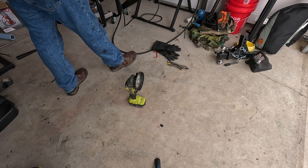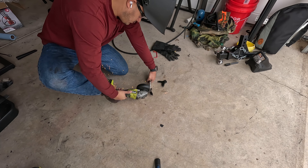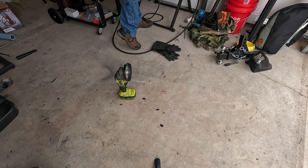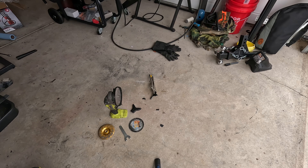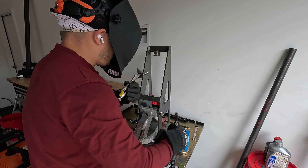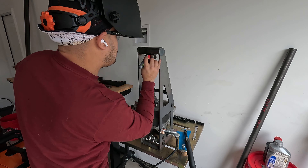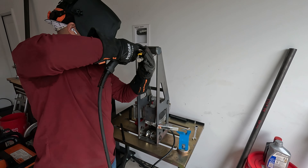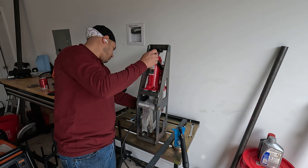Bleeping Colt cut the spring bracket in half and welded the sides onto the upper support at an angle, but when I went to line it up it made more sense to me to just weld them on the way they would normally sit. I ended up cutting and grinding enough to make it work that way, but if I were to do it again I would tack weld the jack retaining cap to the bottom of the spring bracket, and then tack that whole assembly onto the upper support instead of doing it backwards. I did eventually get the whole upper bracket and retaining cap welded on.